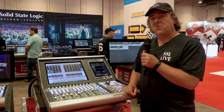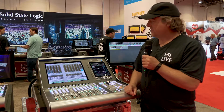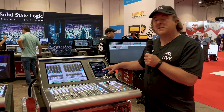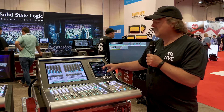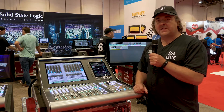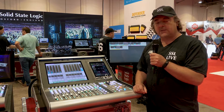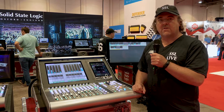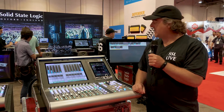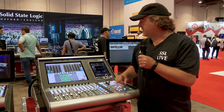This is also running the new V4.7 software which is available for all our live consoles. That also brings in new features on our tablet controller, or TACO as we call it. This is a fully featured tablet controller. We can process any effects rack items, so if you're a monitor engineer you can walk around the stage and trim graphic equalizers or any of the effects within the rack of the console or on the paths of each console.